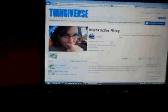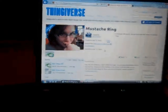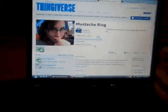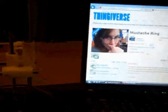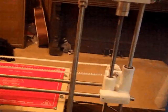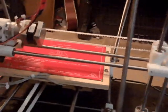The mustache is at different levels, so it actually makes a good test piece to print. After you print it, if you get a complete concentric circle plus flat sides, flat top, and flat bottom, then you'll know your printer is doing infill correctly. Also, the different layers of the mustache portion itself show you how rough the surface is. It won't give you near the accuracy of printing out a 20 or 40 millimeter test block, which a lot of people do to make sure their accuracy is correct.